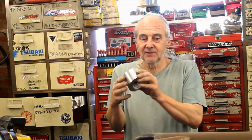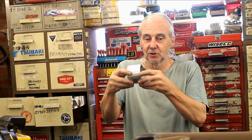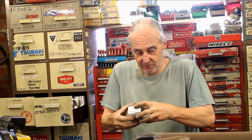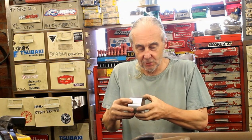When I had the lathe set up with all the mandrels, I've machined them all so you can pop them on. Yes, I made a special thing to go on there so the centre could go in, so you could do all your work on a fixed mandrel. Because you don't want to risk putting that in the chuck and leaving chuck marks.